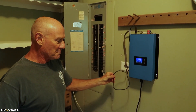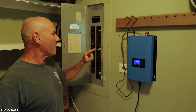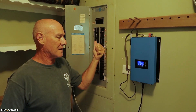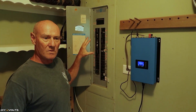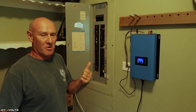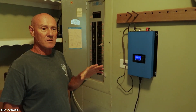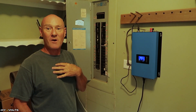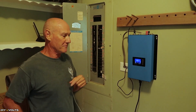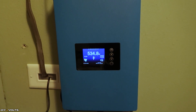This is the sensor wire that tells the inverter whether it's calling for power, and this is essentially what's preventing backfeed out to the grid. In the event that grid power is down, this thing will not be pumping out into the grid, which will protect workers out there. Also, his meter is not geared for reversal, so it would be charging him for power going backwards because it doesn't know the direction. In order to get paid for power, you have to have a different meter socket that analyzes directional flow. So we're humming along under optimal conditions, and he's using what it can create.